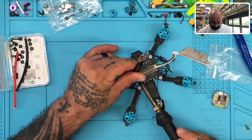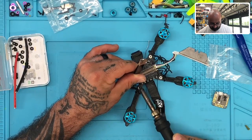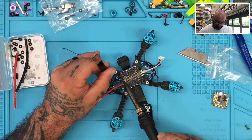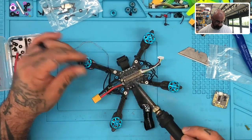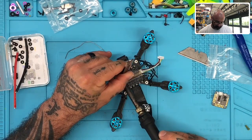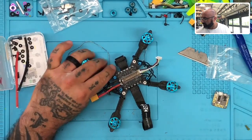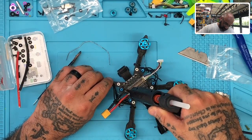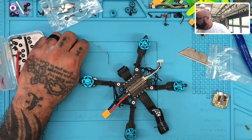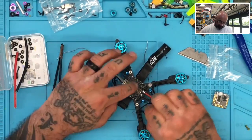Okay. All right, we'll put our ground here. Okay. Excellent. Both connections there are solid. And again, we can now go ahead and give it a little bit of glue to cover these. Some of the things this will help you with: for example, if you have wire strands fraying out, this will definitely protect you from having those touch each other. Once that glue settles, it'll be perfect.